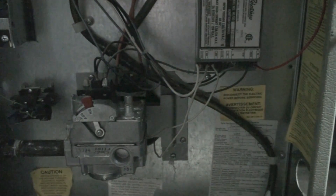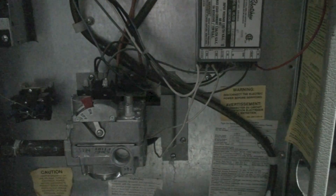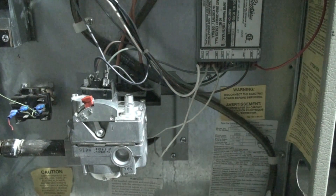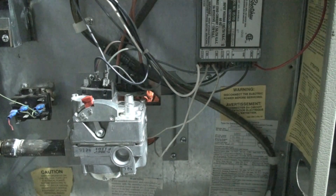Okay, it's shut down now. Let me go over what happened here. There are aldehydes everywhere on this thing. If the pressure switch were to fail, there is nothing in this furnace that will protect or shut the furnace down to tell you that the pressure switch has failed. There's nothing here that'll do that. So if the pressure switch fails and later the inducer fails or the vent gets plugged, this is what's going to happen.